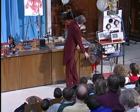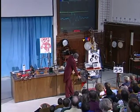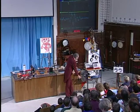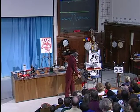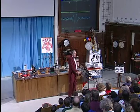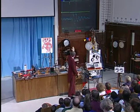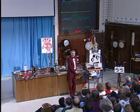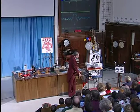So if I turn this on and put it over by the speaker, you can see that the yellow trace there is the sound that is being produced, and you can see the trace on the bottom is what the microphone is picking up. There's a little bit of delay — it occurs a little bit farther to the right, and that means later in time. You also notice that it doesn't look anything like that nice square pulse that's going in, and that's because there are echoes back and forth in the room, so the sound bounces around for a little while before it eventually dies out.